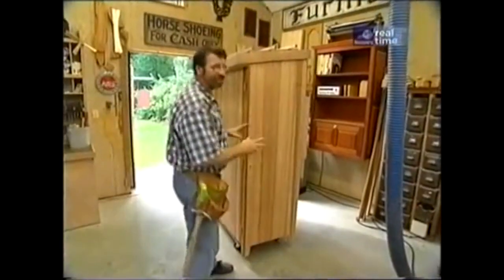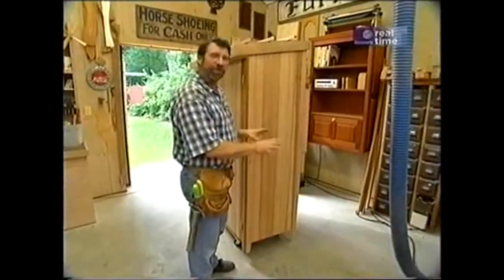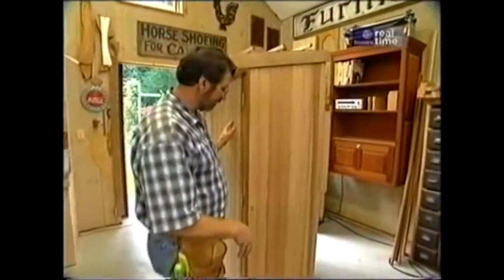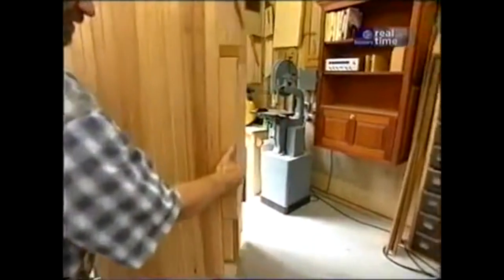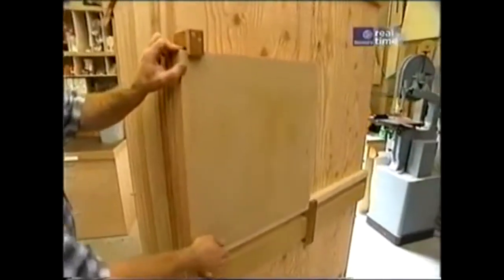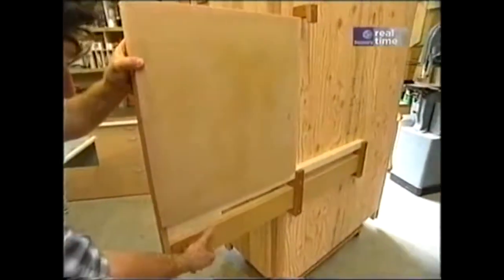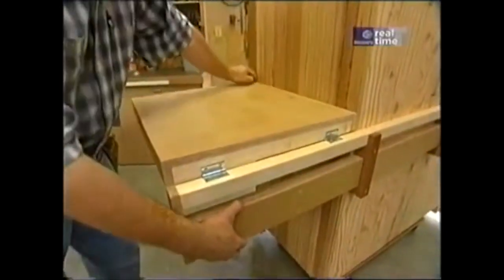When I was designing the piece, we were thinking about an area where we could have a little work surface — a place to put the tools or do a little potting. We thought about putting it inside the door, but that idea didn't work very well. We thought about taking part of the side and having it flip up, but then it would get damaged. So I came up with this concealed unit that goes on the back of the case. There's a little stop at the top, and the work surface slides out through a couple of brackets at the back on a plywood beam, then folds down and sits on a dowel pin in the corner.